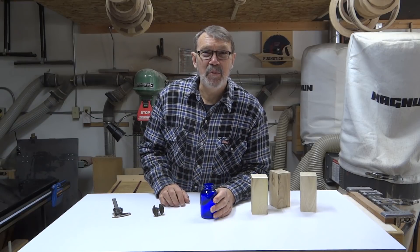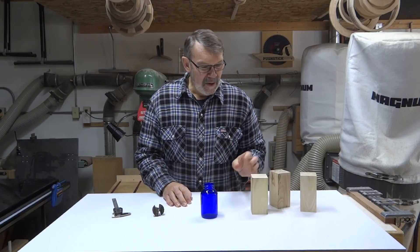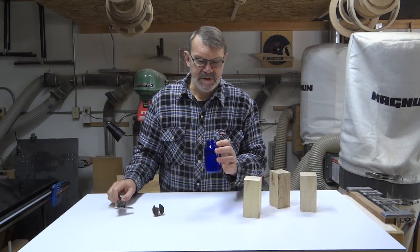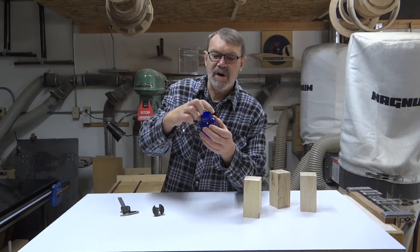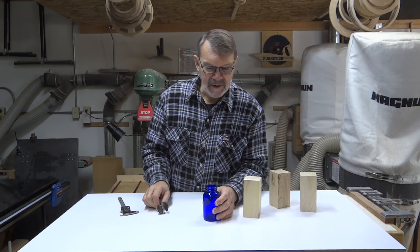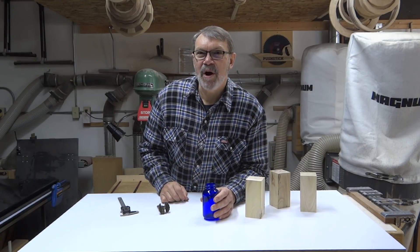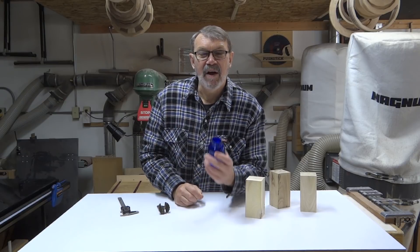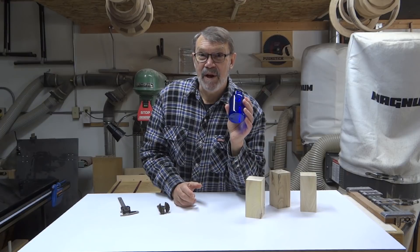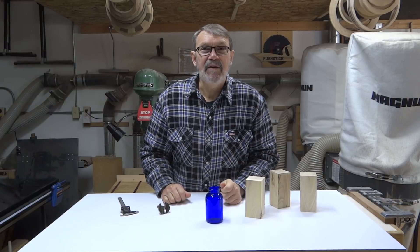I feel really bad not having to duplicate something, but anything for Gail. So I've got three pieces of elm here I'm going to use. According to the calipers, the widest ring around the top here is an inch and three quarters. So I have an inch and three quarters Forstner bit I'm going to use to put the hole into the end, and if that's a little snug I'll just use a parting tool to loosen it up just a hair. I don't want them so tight that if they shrink they might break this glass — that wouldn't make my day. So let's go over to the lathe and take a look at this.